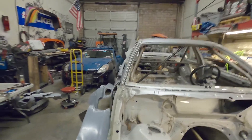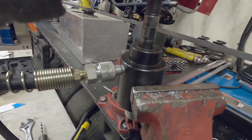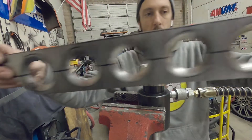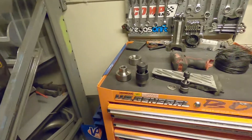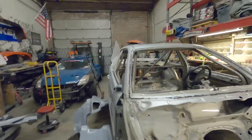I'll show you a little video of what it's like to press one of these in. With the bolt-through dies, what I use is a Harbor Freight hand hydraulic press — I'll put a picture of it up there. It works with that three-quarter inch bolt and you can do them on your bench, you don't need the big press, and you can do it on the car or anywhere. And there you have it — that's dimple die 101. Have fun, build some cool race cars, keep learning. See you guys later.